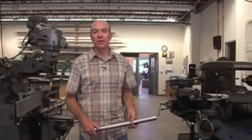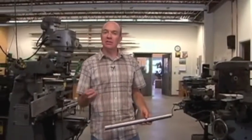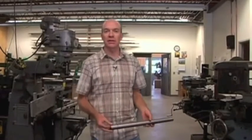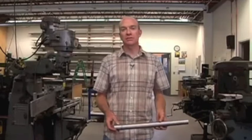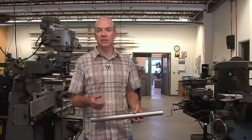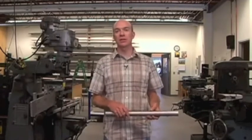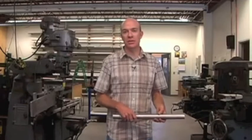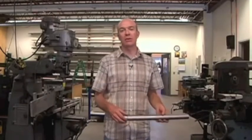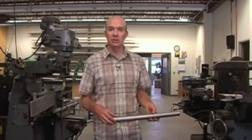This is the main mitering room at Moots. This is where all of the raw tubing comes in — not just any raw tubing, but US-made aerospace-grade tubing. For the mainstays of the frames, they use titanium that is 3/2.5, meaning 3% aluminum and 2.5% vanadium mixed into pure titanium. That gives an alloyed tube that is stiff, strong, and very resilient for bicycle building.